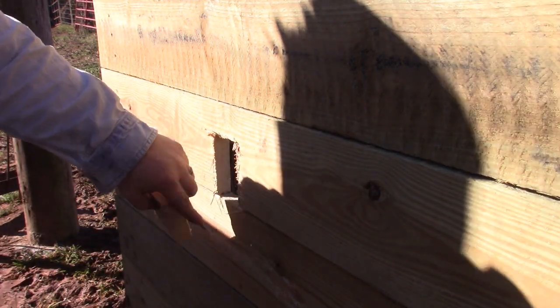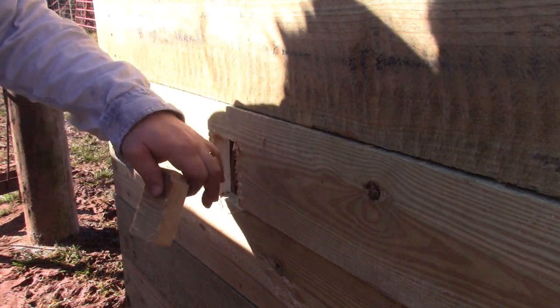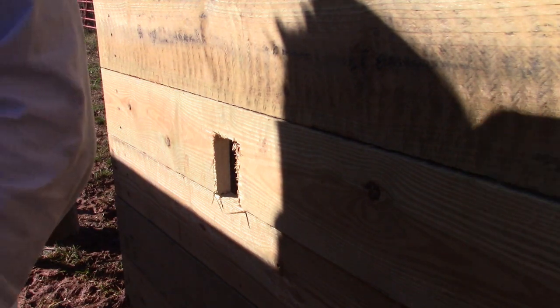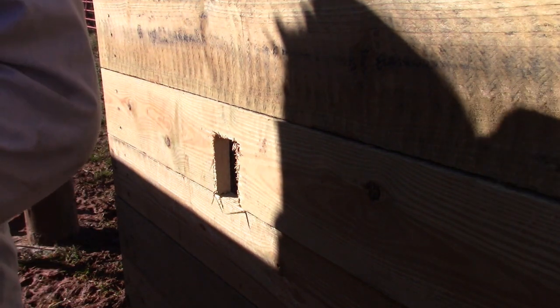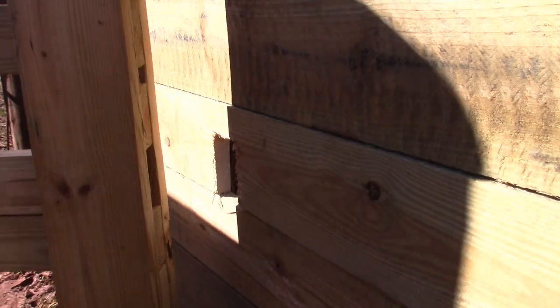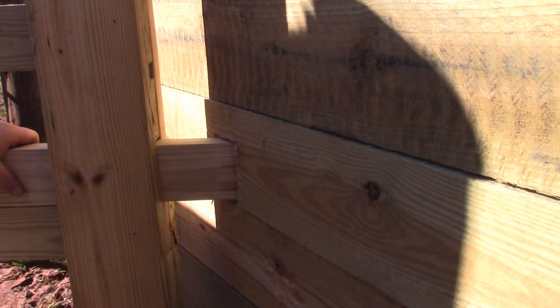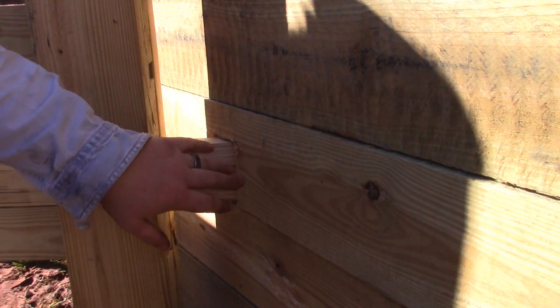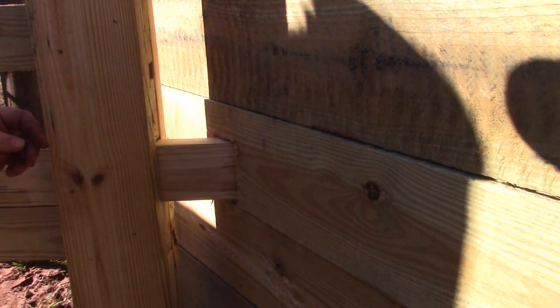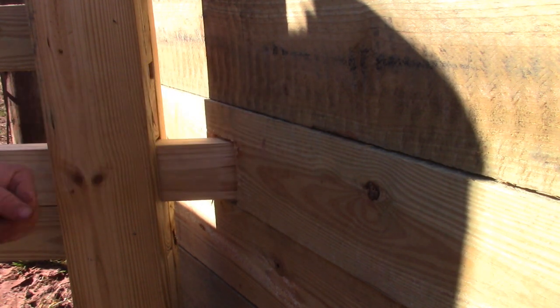And well, of course, I have to reinforce. I'll probably reinforce this on both sides, just because so much of that board is sticking out, I'll be a little bit worried about it. So, swing this gate this way. Make sure that fits. This is at a pretty good angle, so I ended up having to cut it. Now, what I'll have to do is go on the back side and just butt the reinforcement up against this, because it's at such an angle here, and that's just because this gate hitting it isn't equal distance